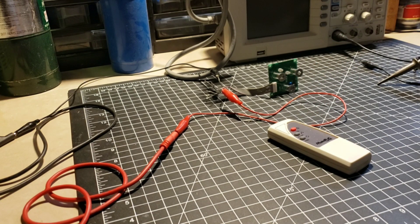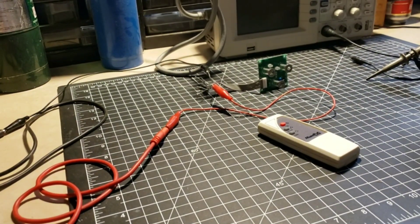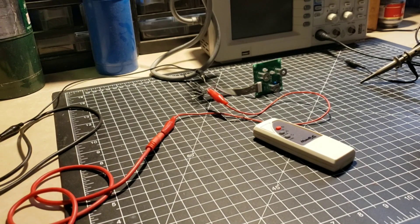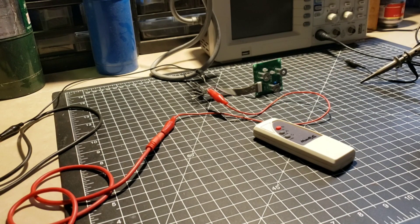After messing with the relay board, I determined that it seemed to be okay. The problem ended up being the control board. After taking it off and putting it on a stable 5-volt power supply, it is working great. My guess is the 5-volt supply going to that board has some spikes or noise — some kind of issue. There are about 75 bucks to replace this board, but I suspect it's probably going to be a bad diode or capacitor, so it'll probably cost you 10 cents to fix at home.